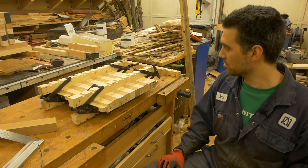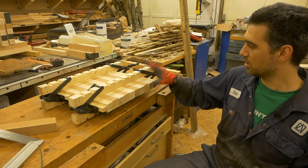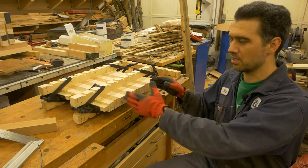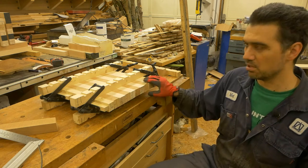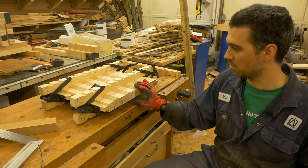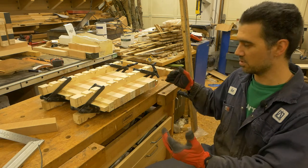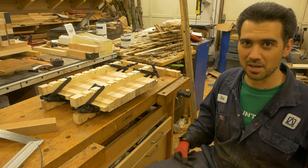Now I have to focus on the gluing. My idea is to keep the wood in this setup for about two to three hours, then move it to my regular clamps, and then glue in the next set of pieces. I have about nine setups like these to glue, so that may be a two-day process. Everything is coming to an exciting end — stay tuned for gluing!